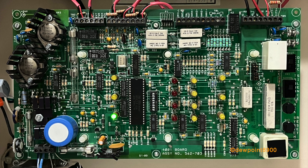The 4001 could use a hardwired annunciator, and each LED could be supervised for continuity. With its microprocessor, the 4001 had additional features set by DIP switches on the circuit board. There were several coding options for the signal circuit, alarm verification for two-wire detectors, walk test, and others. These changes would apply upon a system reset.